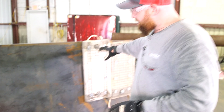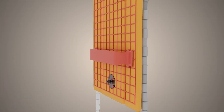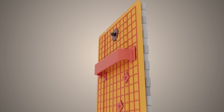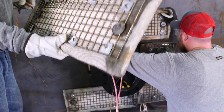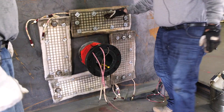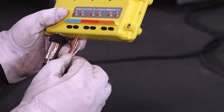These are the Magnemats. What we're just gonna do is move them into location and you'll see how they stick. Here are our magnets — this is what adheres to the metal shell. This is our ceramic heater and we've got built-in insulation right on here. So we've got our setup all queued up. All we do is get these things lined up and they pop right into place. Now all we're gonna do is attach our TCs to control the shell temperature, get it hooked up, and we'll be ready to go.